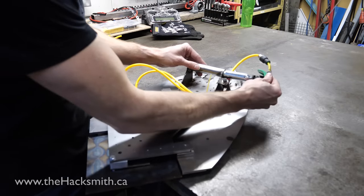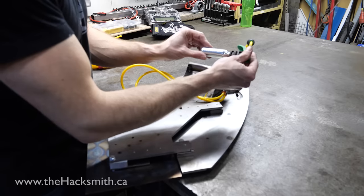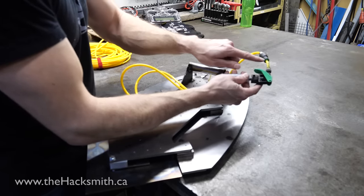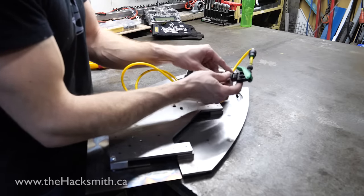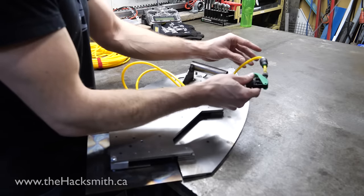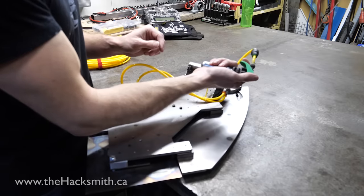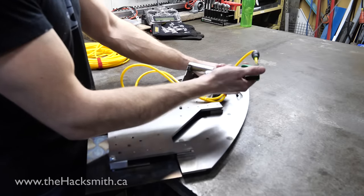All right, so how's it actually actuating? Well, what we're doing is we're actually using a 16 gram CO2 cartridge as the air source for the project. And it runs through a check valve. And what a check valve means is pressure can only flow through the check valve in this direction. So when you build up pressure in here, it doesn't try and escape back over here. When you press the button, it goes into the extended position.